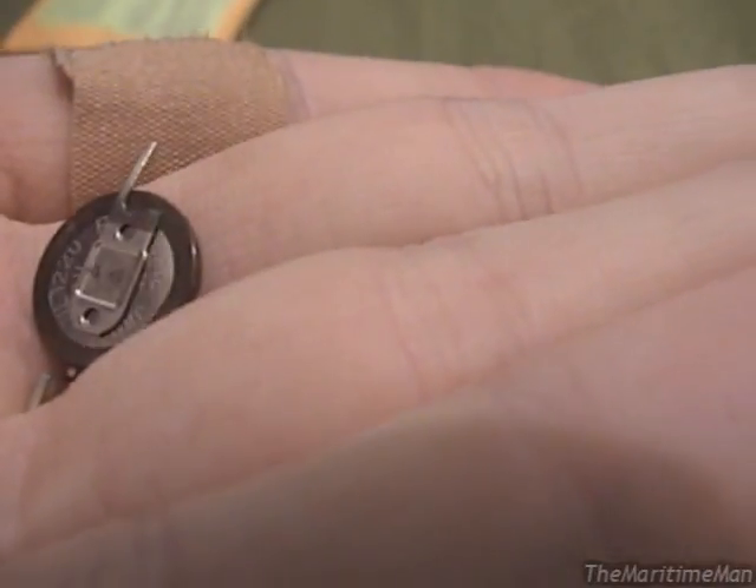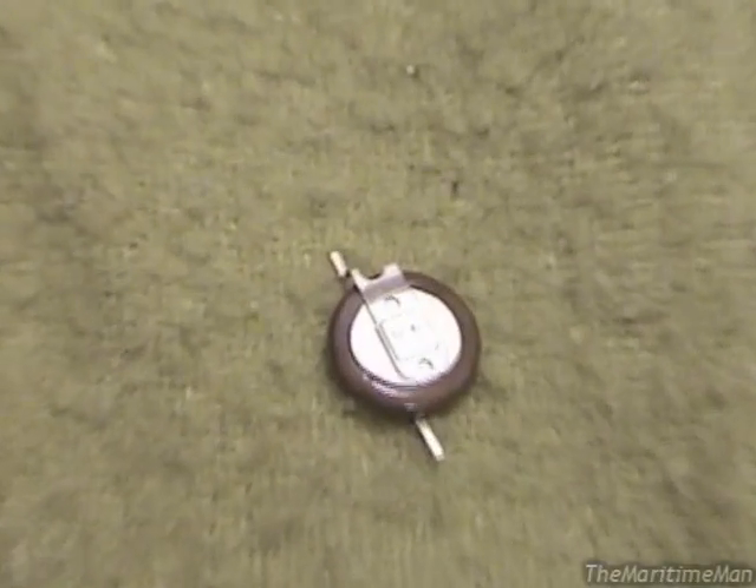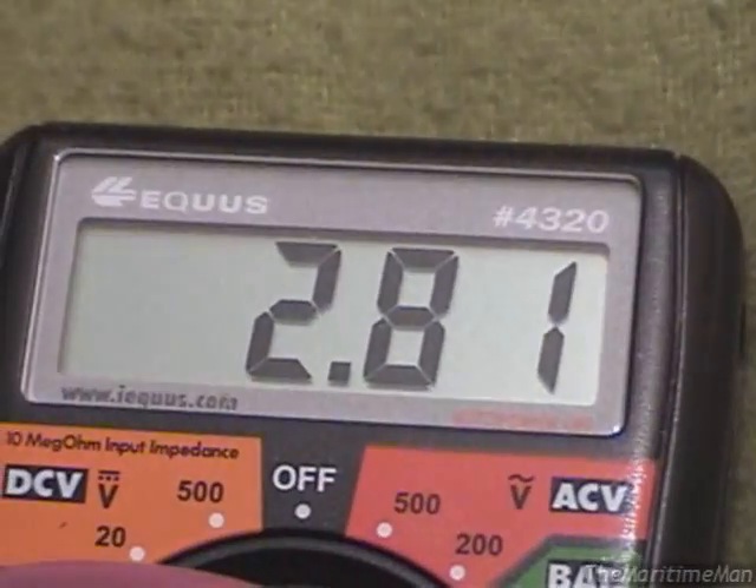Hopefully the battery is still charged. If not, I suppose I can hook it up to a couple of AAA batteries or something to charge it. It's a Panasonic VL1220 — an actual Panasonic battery, not some generic equivalent. I think perhaps Panasonic is the only one that makes this. It's a rechargeable lithium battery, I think 3.3 volts. I'll get my multimeter and measure the voltage across it — it's a little low, 2.8 volts.